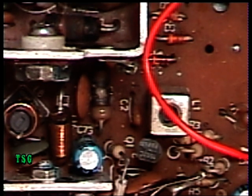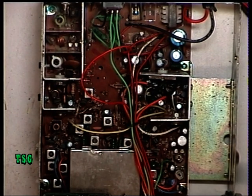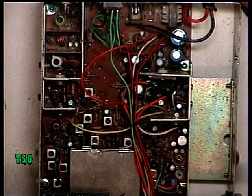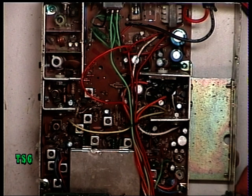If you wonder what the rattle is in the background, I've got a colleague here working on a guitar amplifier. We've changed the resistor for a new one — it's part of the transmitter. A common fault on these is that if you've had a high SWR the resistor can go high in value. In fact the one that came out was still working — it was doing 14.5 ohms; I think it should be something like 0.3 ohms. So this radio would have worked with that faulty part in, but you'd have been doing about half a watt, and you're hard-pushed to get more than two and a half to three watts out of these anyway.